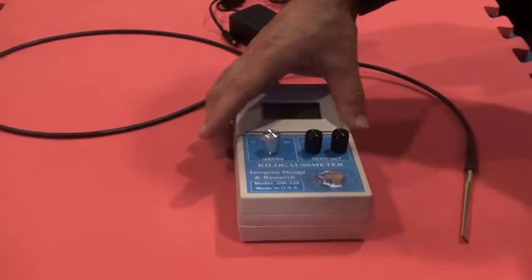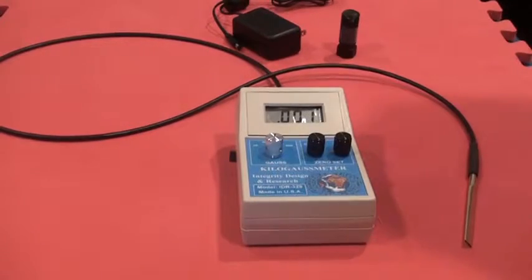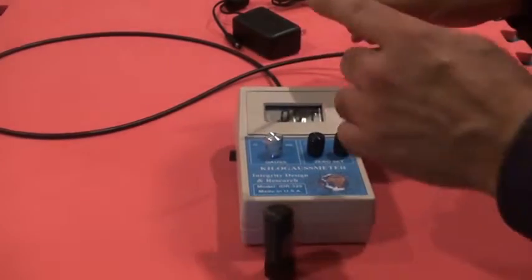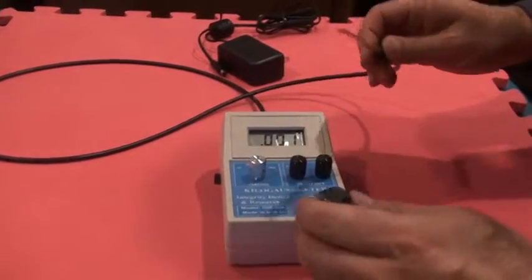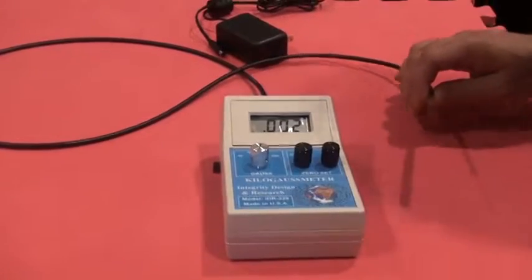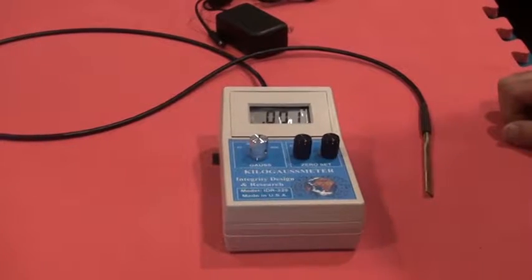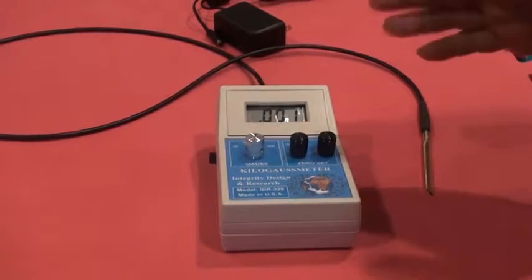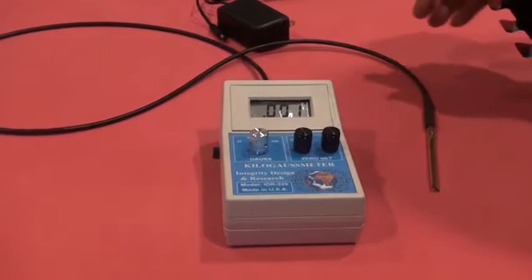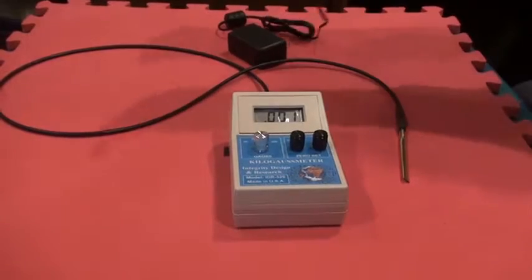Okay. This is a review of what we've spoken about. First, you turn on your meter and you zero out your meter and you bring a transverse probe, and the magnetic field has to be perpendicular to the sensor. You bring a magnet and you take a measurement. After that, you slide the magnet away, and the meter has to come back to zero. Once in a while, if you are taking a long measurement, please check the zeroing often to make sure the meter starts from zero.